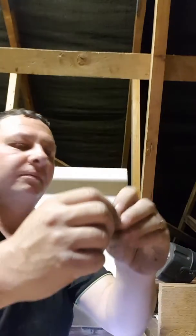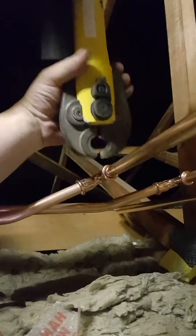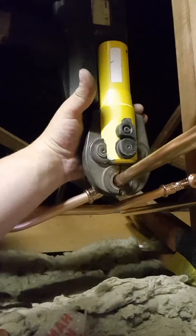As we can see over here, I'm just going to pick the phone up and take it over so you can see the type of fittings used — nice and straightforward. I'm just going to press one now so you can actually see how quick and efficient this system is. You can see the jaws go on there — different fittings use different jaws. These ones are M fittings, M press.